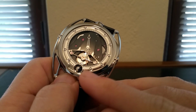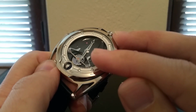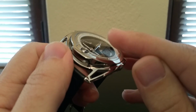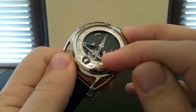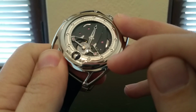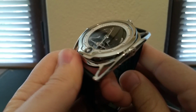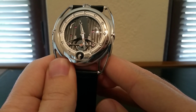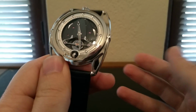And the whole escapement and balance mechanism is mounted on this really innovative shock absorption system. So you can see these bars mount into the top of the movement there and come down and then hold everything on this really neat, almost tourbillon-like bridge. And that's all mounted on these kind of shock absorbers. So this should be a really durable watch. It would be very difficult to hurt that mechanism with that amount of shock absorption that's there. So another really cool feature.